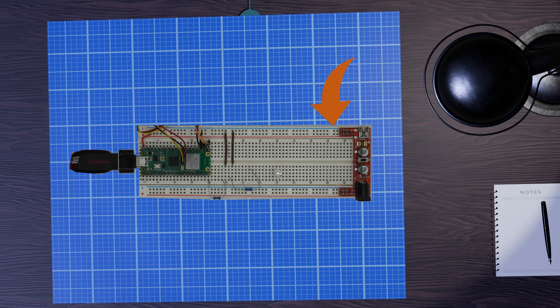I'm going to place a separate PSU onto my breadboard and drive five volts into the bus. You could also potentially do this via a powered USB hub, with USB and power coming through that hub. When I tried that, I didn't actually have a great deal of success with it — hence why I ended up going with the separate PSU route, which mounts and works nicely. There is reference to being able to do it via USB hubs, but it may be that particular hubs are liked by Picos and some aren't.